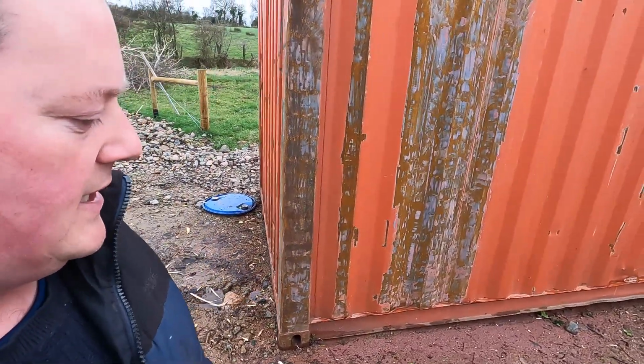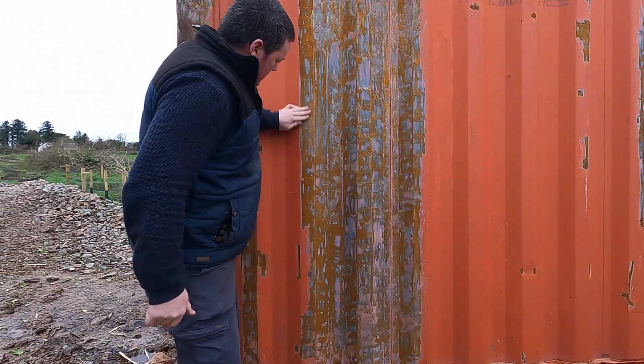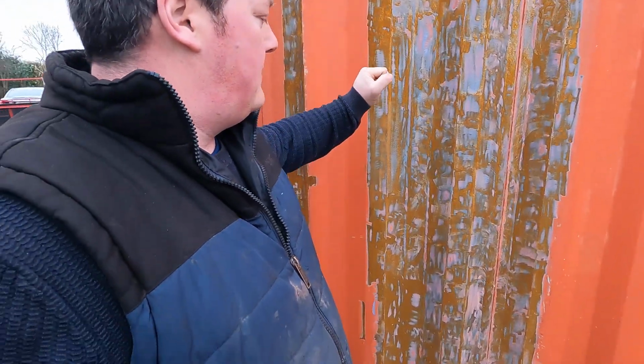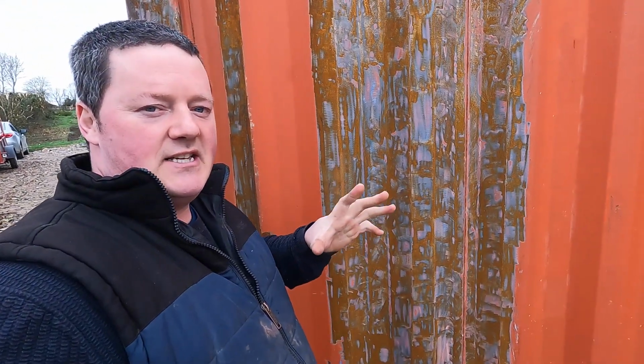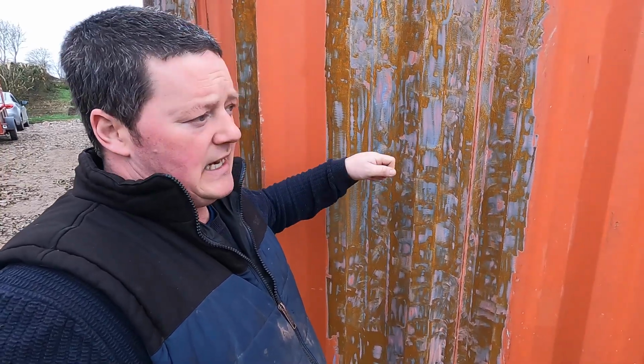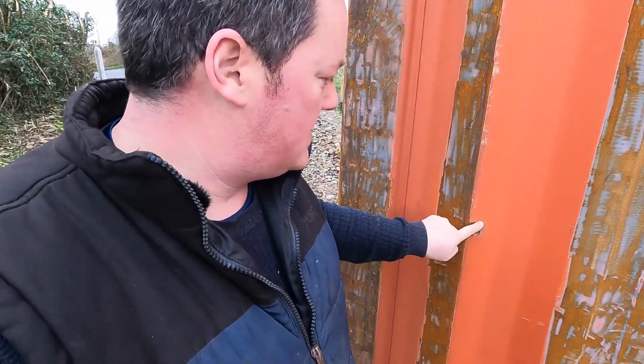If you notice, I haven't painted it, but look at this. That's only rain rust. It's only a stain. I'll take a sanding disc. I've already got 6-inch or 150mm 120 grit sand discs, and while I have the generator again, I'll go around and take off all these edges, soften them so that whenever you repaint it, it'll not show up as much.